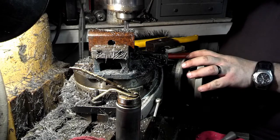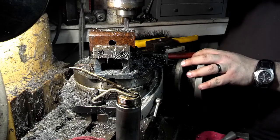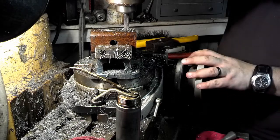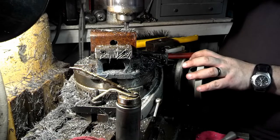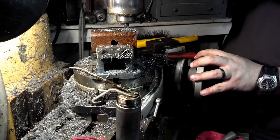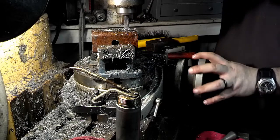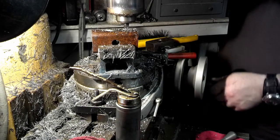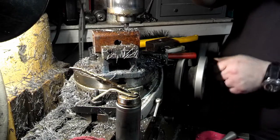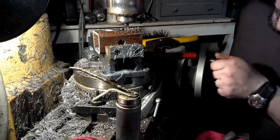Well, that sleeve has two grooves, and you're supposed to use the little pointed grub screw to hold the thing onto the shaft, but the problem is you can't actually tighten that grub screw down. So what I did is I took the grub screw and squished it in the curved vise between a set of jaws to kind of mangle the threads a little bit, putting little blunt flats on them. That acted like a deformed thread, so the screw would stay at a non-fully seated position just because of the interference of the threads. Worked really well.